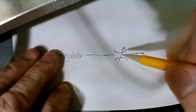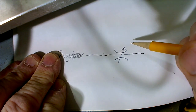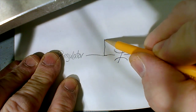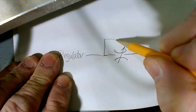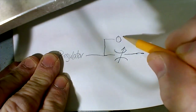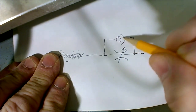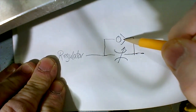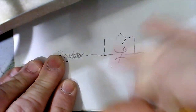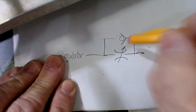So it doesn't distinguish between the directions, but gives you the same meter effect in both directions with a plain needle valve. This one actually has a bypass check built into the valve, which means that parallel inside of the needle valve, you have a check valve. And it goes like this. You have a ball check, a V. Y'all recognize that being a check valve? Let's draw the ball close against it. The ball goes against the seat.